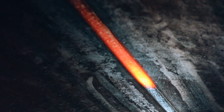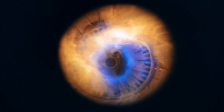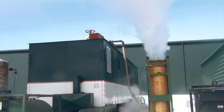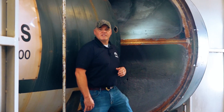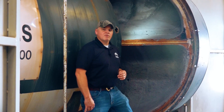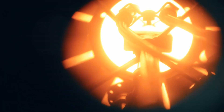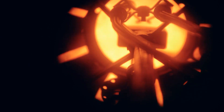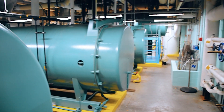Recently we were talking about the construction of boilers through ASME welding procedures. The fabrication of boilers and their steel components rely heavily on extreme temperatures, as does the process of steam production. It is therefore extremely important to protect the steel of the boilers from these high temperatures. The fireside of a boiler can see temperatures in excess of 2,000 degrees or more in the initial pass, and these metal surfaces are subject to premature failure and shock if they are not properly shielded.